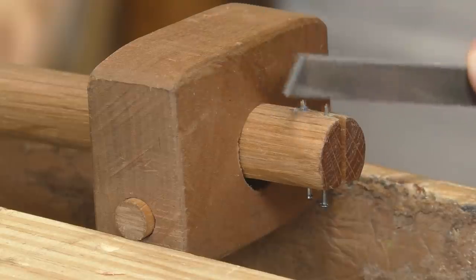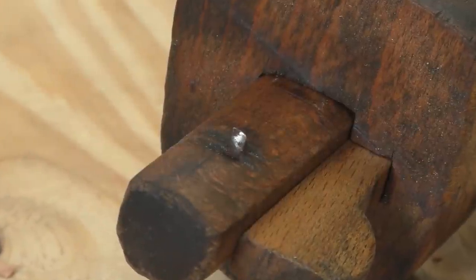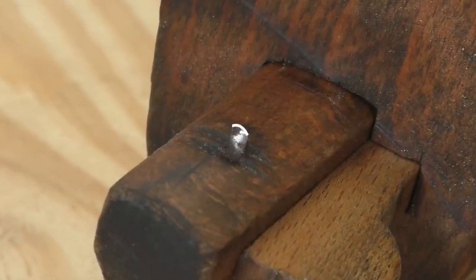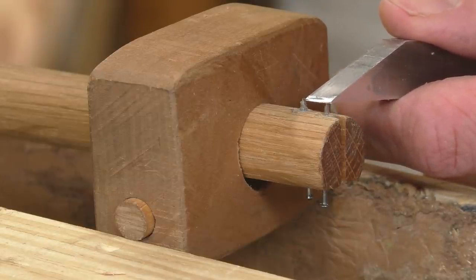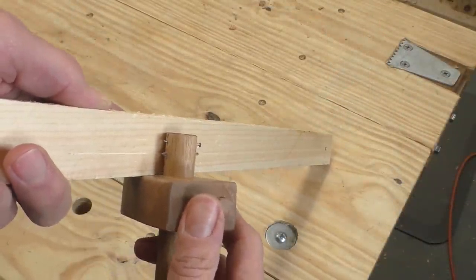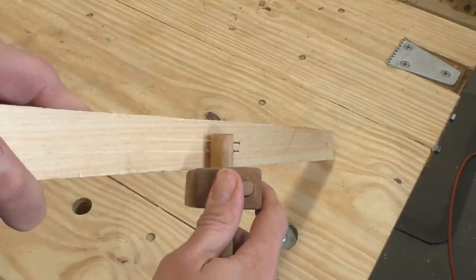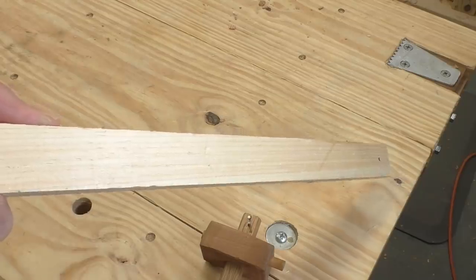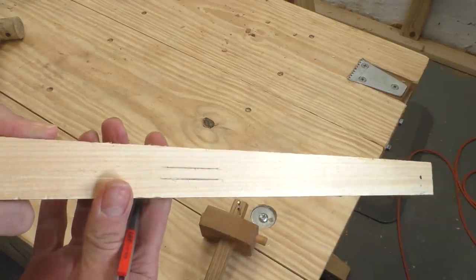Notice that I'm angling my file up and working from both sides of each pin. You don't want a little point at the tip — that would just scratch the wood. Look at this old shop-made gauge. Notice how the pin has a definite curve from front to back. The maker filed this pin into a blade shape so that it slices through the fibers as you push the gauge across the work. Your pins should be knife sharp, equal in height, and curved front to back. As you work, bring the chisel in and check the corners against the tips of your pins. I adjusted mine four or five times while making this video, and now it's perfect. When you mark your mortise, keep the fence firmly against your reference edge and push the gauge as you slowly roll it forward into the cut. Take three or four light passes — this keeps the grain from grabbing the cutters and pulling them off course. After a few light strokes, you should have clear marks that are easy to see. In some woods, you'll need to run a pencil into those lines to make them more visible.